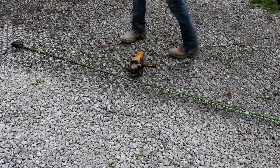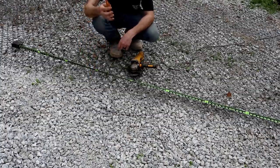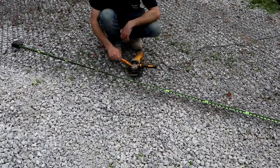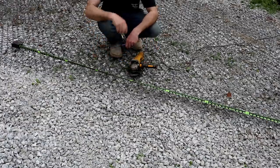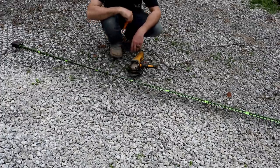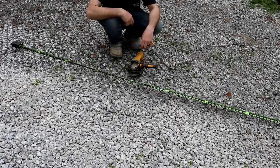The only times, knock on wood, that I've been hurt in the shop really bad twice has been with one of these, an angle grinder. I'm about to cut this fencing to the length that I need, but I figured I'd share a story with you. I've been to the hospital twice because of one of these, or maybe more than twice, actually. That was from sparks in the eyes, but those aren't the real bad injuries, although they could have been. You go to the hospital, they put dye and stuff in your eye. They use a magnet to remove the metal chunks that get in there. Sometimes you have to go to an eye specialist to get it out, which I have had to do as well. All while wearing safety glasses, they can get between the cracks and stuff on your safety glasses.